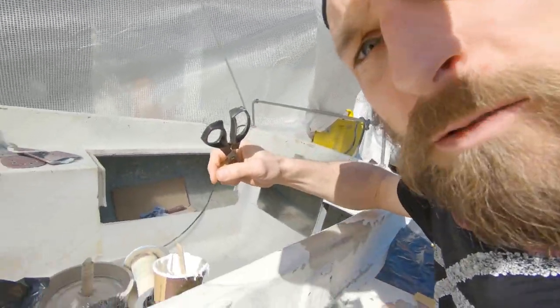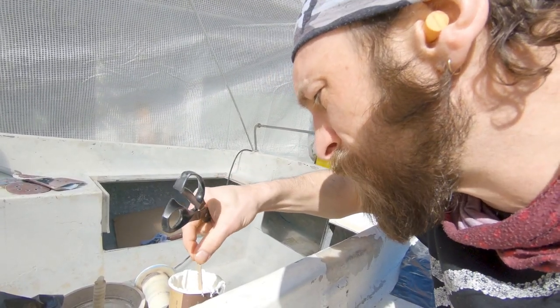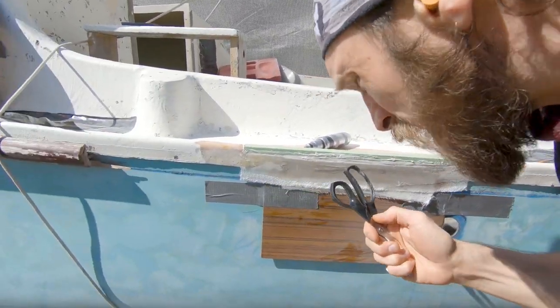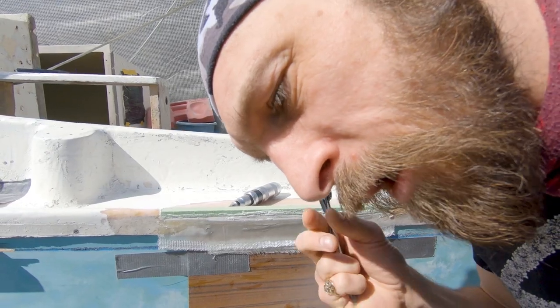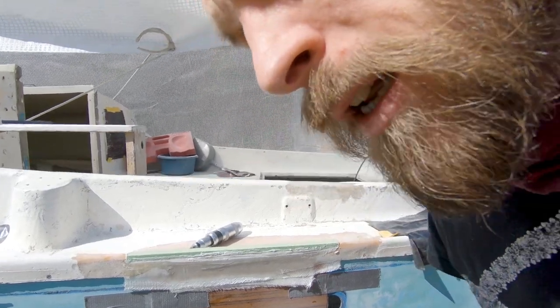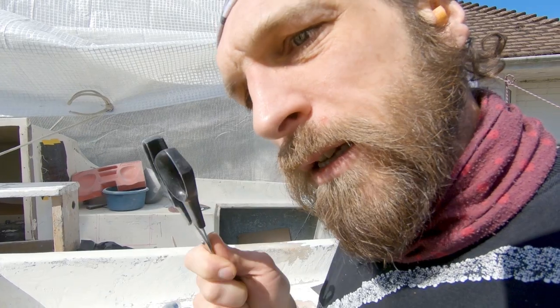Okay. Well, I've got the pot that I mixed up the filler with the micro balloons, the epoxy. It's rubbery. I've read on the internet that it's not going to be ready, but here it is. And it's quite thick, the filler. I've been warned that thick epoxy filler underneath the foam can generate heat, and the foam can insulate that heat, and it could be dangerous. Seems to be okay. But yeah, so I've read on the internet that that's going to take 3 days to go off, so I'll go and do something else. But I will finish the repair underneath by applying the tapes back. We can have a look at that inside.